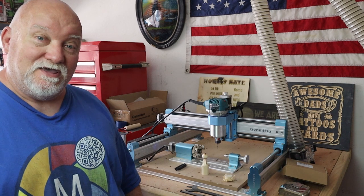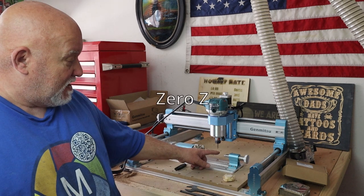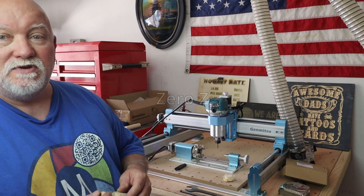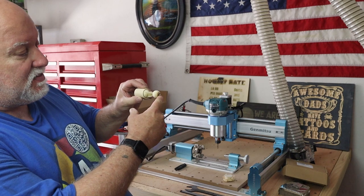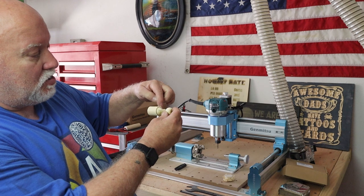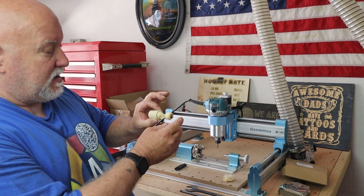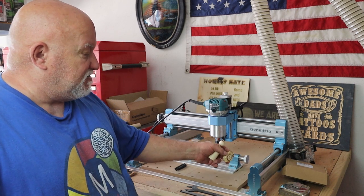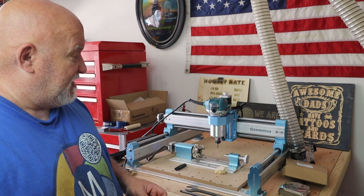That almost got done, as you've seen. When I homed my Z, I had it right down to the point but didn't have it perfectly homed. When cutting off the tip on one side, I should have left a little bit of material, raised up, gone over and cut most of the way down leaving a little on both sides. It wound up going all the way through, and because I had pressure on it, it started to bind up, so I hit the emergency stop. Live and learn.